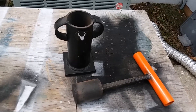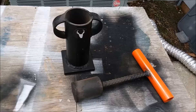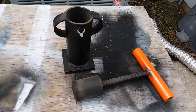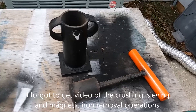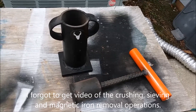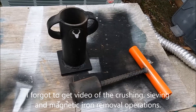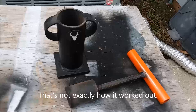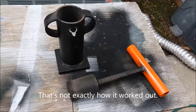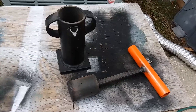I think what I'm going to do is treat it with aqua regia. I was going to think about panning it for the instant gratification of seeing the gold, but there's a lot of base metal in there that really needs to be dissolved away. So what I'll do is crush it, use a magnet to remove any iron or steel, and then treat the resulting powder with aqua regia. That should get all of the gold and any other precious metals in there out.